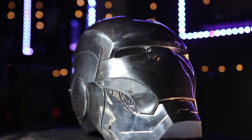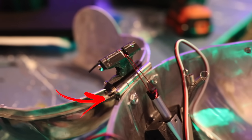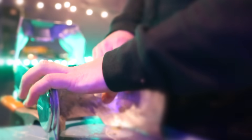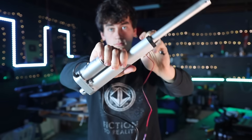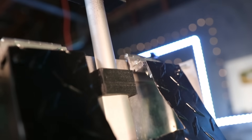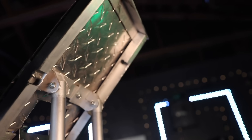The helmet weighs about four pounds on its own — not too bad — and the linear actuators are rated for more than that, but the physics are not in our favor. We're pulling from right up near the fulcrum, so the short distance of travel means we need massive torque. I couldn't actually physically do it myself, so there's no way a small linear actuator could do it — we need a better mechanical advantage. So I stepped it up and got much bigger actuators. Why do we need all the electronics packed inside the helmet? We're gonna have to have some sort of backpack anyways — might as well just stick all the electronics in there. My new design uses one actuator to move the helmet up and down, and two more to rotate a plate that pushes the helmet up and around onto my head, all mounted to a full metal frame.